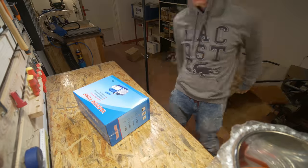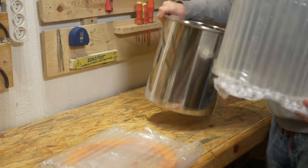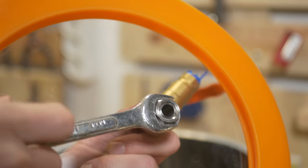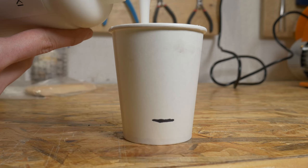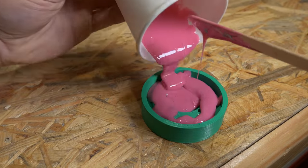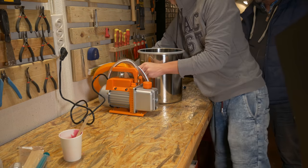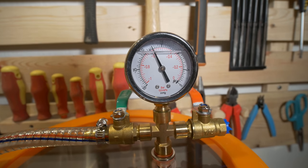The vacuum chamber is made out of steel with a thick acrylic top piece, gaskets, valves, and a vacuum pump. It's easy to DIY, but if you want to buy one there is a link in the description. If you have a model of what you want to cast, you can measure how much silicone you need in Fusion 360, then mix the silicone with the catalyst. It's a good idea to put it in the vacuum chamber after mixing and before pouring to get all the air bubbles out — which I hadn't done here but did later when making more molds. The oil level in the vacuum pump was pretty low so I couldn't go very low on pressure, but it still worked and got most of the bubbles out.